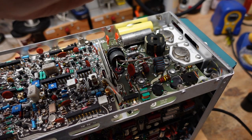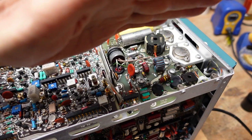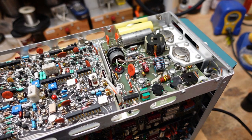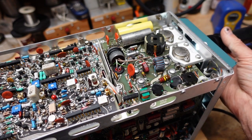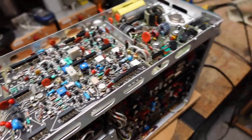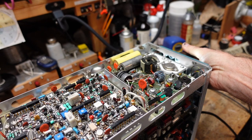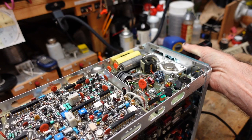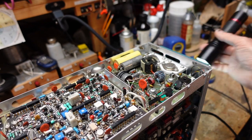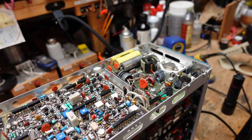You can see that flashing. The other interesting thing is the fan - you can see it's just kind of jiggling a little bit. It's like the inverter is starting up but there's something going on with the power supply, maybe something loading it down. Something you need to be aware of when working on these - I'm going to turn this off and get the meter.